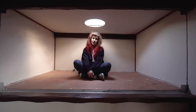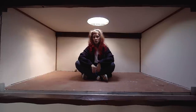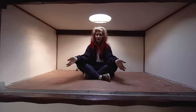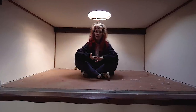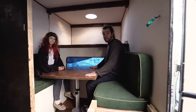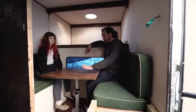You might remember at the start of this video when I was talking about how good lime wash would be for use in a van — well, it turns out it wasn't. As you can see, this isn't lime wash anymore, it's just regular emulsion. As much as I really wanted to stick it out with my beloved lime wash technique, it just wasn't meant to be. It's not so much the lime wash itself — more the material I was putting it onto. It's not really made for plywood, even with the extra layer of PVA underneath, and because of the various textures it just works better on a larger scale. In a small space it ended up looking quite busy — probably better as a feature wall, not an entire room. And honestly, the amount of time and labour — doing five or even six coats on each surface — it's just not worth it. So we've gone for a really nice earthy tone emulsion which offsets everything else in the van much nicer. We're back in the seating area and we've got our lovely cushions back from the embroidery shop — they're gorgeous, everything we wanted for the colour scheme.